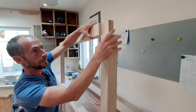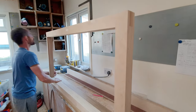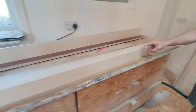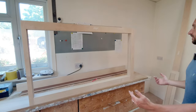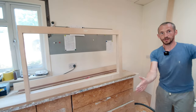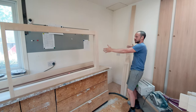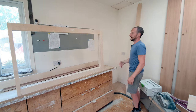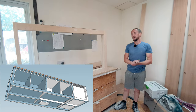So the top is going in. Nice chunky frame — four layers in thickness. There's going to be three frames: one, two, three, and then the tunnel carcass runs through and they all get connected. And then we've got another carcass for the second bench section — again, one, two, three frames and a tunnel carcass runs through. These would just get joined with bolts. Once the tunnel carcass is in, your bench is nearly there — you literally just put a top on. So that is my technique.